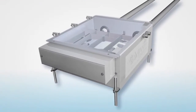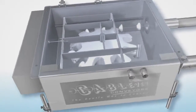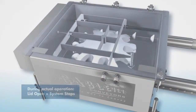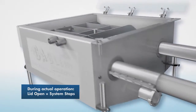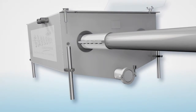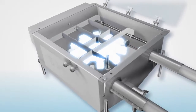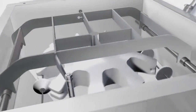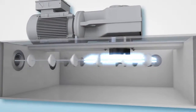We have designed our tensioning turnaround unit to hold and easily discharge water, foam, and any accumulation of material during the normal conveying process. The angled base of the turnaround box directs water, foam, and debris to the funnel. Attached to the idler frame is a food-grade plastic sprocket wheel. A similar sprocket assembly is used within our drive unit.